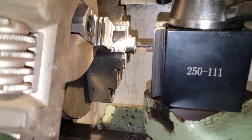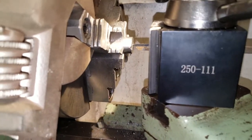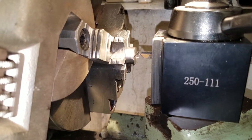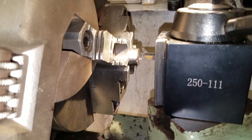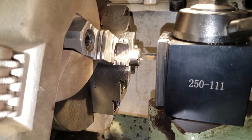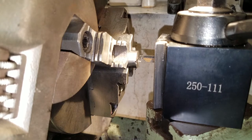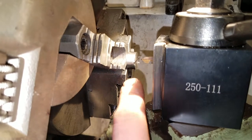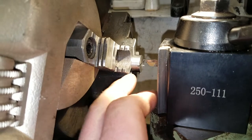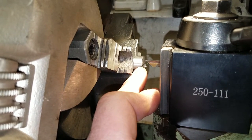It's a little trick that seems to work. Needed it done today — it's for the Bridgeport lock nut for the Y-axis lead screw. It got pulled out. The screw is this one here; it's a 5/16-18 thread, about an inch long. I think that's a 3/4-inch diameter.